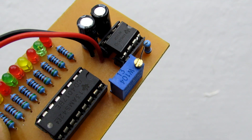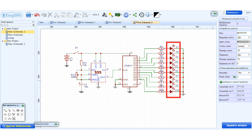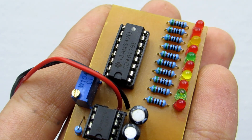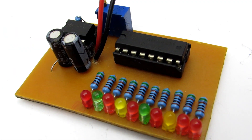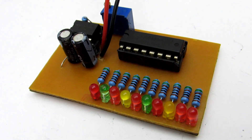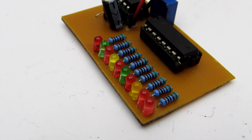Since the chip has 10 outputs, it is possible to connect 10 LEDs. Moreover, it is possible to connect 2 to 3 LEDs in series to each output. I miscalculated the LED diameter a little, so when installed vertically you need to twirl away the plastic case slightly. Note this during assembly, or use SMD LEDs which can be soldered to the PCB track side.